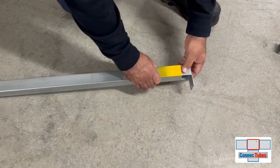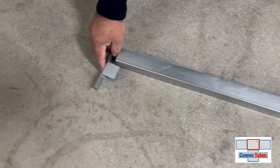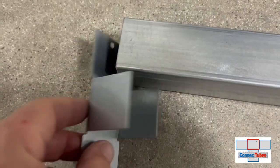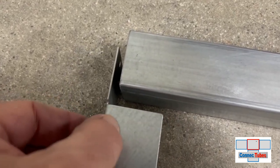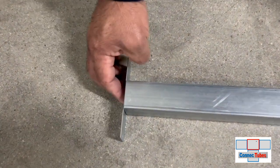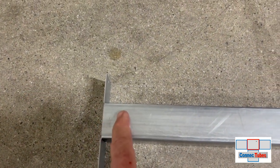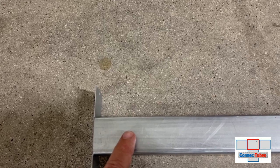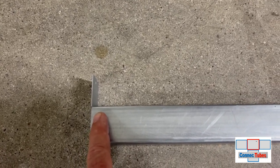To install a vertical tube, go ahead and install your one-way coupler into the vertical tube. When screwing in your one-way couplers, you can see it's open on one end with a little bit of flex, while it's more rigid near the solid side. You should aim your screw close to the rigid side. If you come down to the open end, you could miss the coupler or it could bend in and you won't get a good secure hold. So always aim high near the solid and rigid side on these one-way couplers.